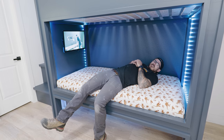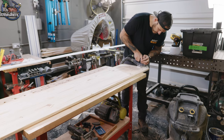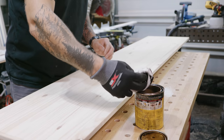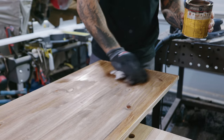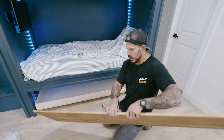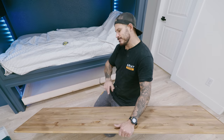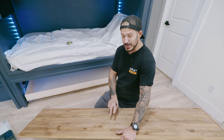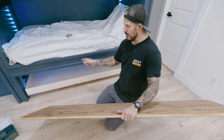It works. I wish I had something like this when I was a kid. For the trundle drawer face, I wanted to simplify it but also make it a little bit of an accent piece. Instead of plywood, I picked up some pre-fab project paneling - glued up, available at your local hardware store, usually between $28 and $30. It works out way better than buying a full sheet of plywood. For the stain, it's a semi-transparent walnut. I'll secure it in place, put a couple of knobs, and throw a mattress in.